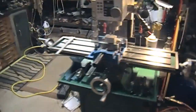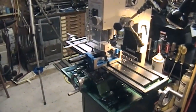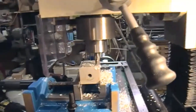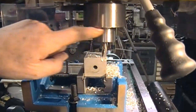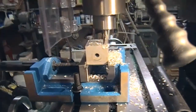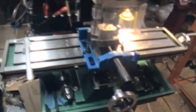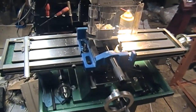The light isn't ideal — very temporary. I had an idea from a website, mikesworkshop.com. He had bought a couple of rings of angel eyes, which is a circle of LEDs. He put them in a little holder and put them round outside the spindle. They're only 12 volts, so it'll need a battery or a little power supply, but that should flood the work area with light, which is better than what I've got at the moment.